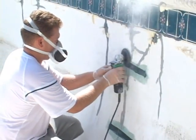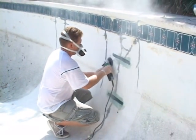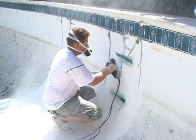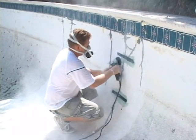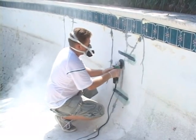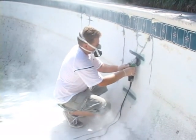Sand all epoxy and foam off of the crack, making it as clean as when you arrived. Step 9: Saw cut over the entire length of the crack, at least a quarter of an inch into the crack. Fill in the saw cut with plaster, matching the existing plaster to the best of your ability. Once complete, begin filling the pool to normal operating level.